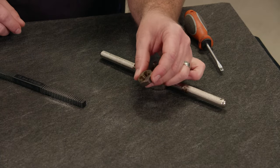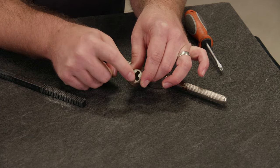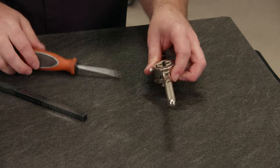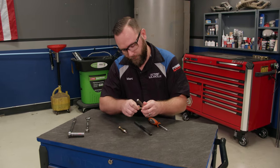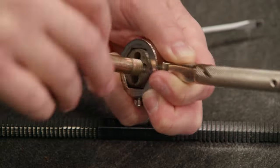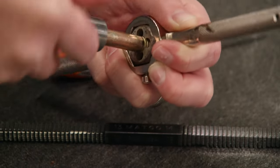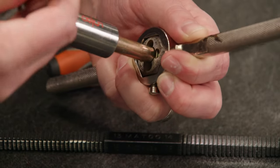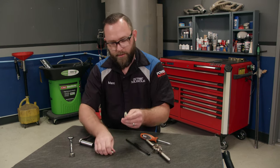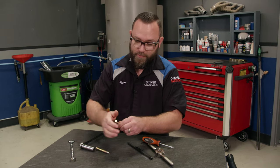This is just your run-of-the-mill die out of a tap and die set. It's wider on this side and tightens up as it comes through to the other side — that's what cuts the threads, those teeth down inside there. We're just going to install it in this T-handle here and get it tightened down into place. We can run our bolt through this way. All right, looks like we lost a couple of threads there at the end, but that's okay. If you're trying to salvage a bolt you can usually withstand that. Let's see if this nut goes on there — nice and easy.